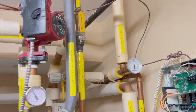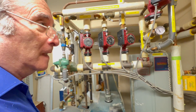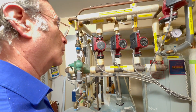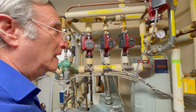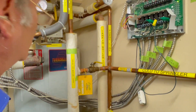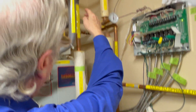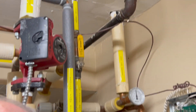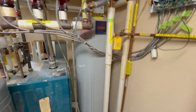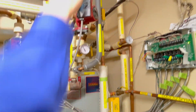If we back up just a little bit, the water coming into the house is a pipe behind the wall. It splits behind the wall: the first split goes to all the cold water faucets in the house, and the other split comes into the boiler room here — this cold water pipe goes into the water tank. Hot water for the house is actually in two stages: the water comes in, goes through this water tank, comes out the top, and out to the house.